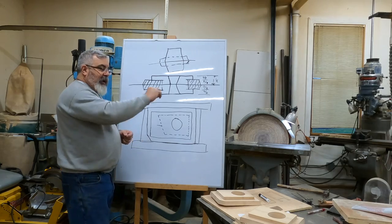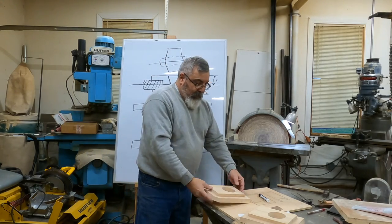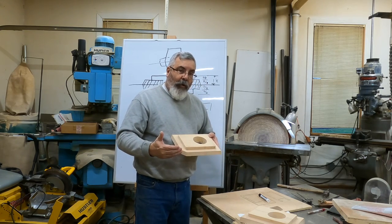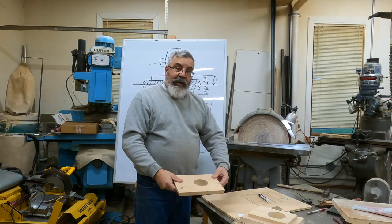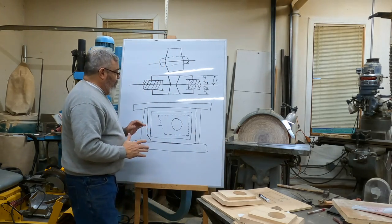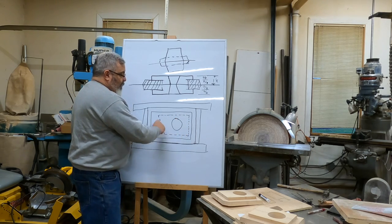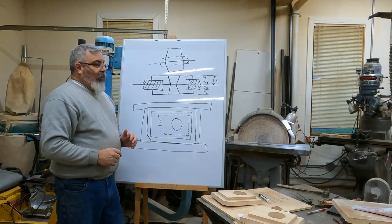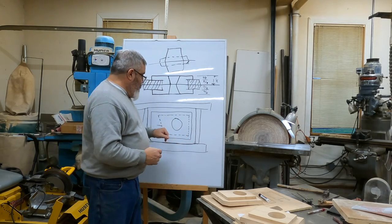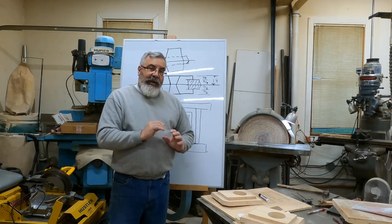Then after that, you've got the outside that's going to fit into the mold, all right? These core prints are going to make an imprint in the mold. All right, so the core's got to set in there, okay? So from there, the biggest part is this dotted line configuration right here, okay? What we'll do with that, this is another 7/8 piece, and all we've got to do is make that configuration and put it inside that box, okay?